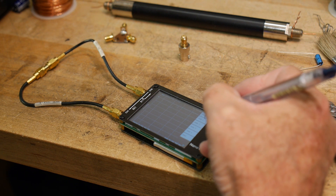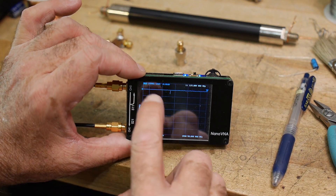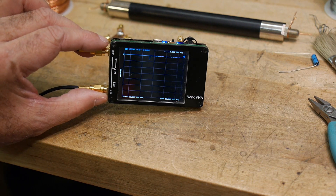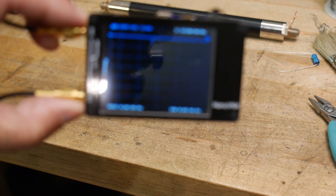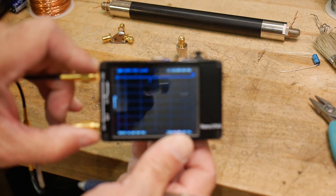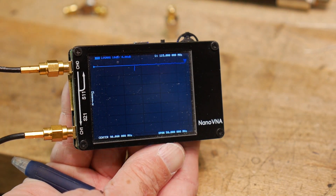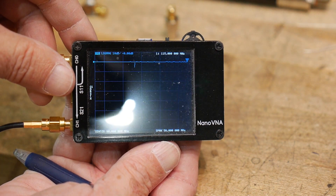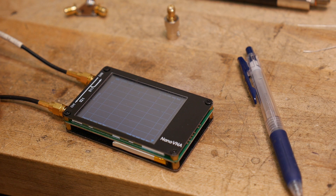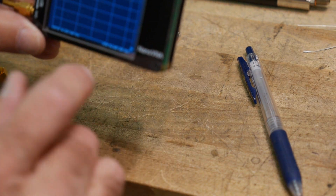We are done. Let's go ahead and save that in one. So we now have a trace along the top. I know it's going to be hard to see. So we're going to have a line up at the top and that just says that we don't have any transmission loss in the system. And when we open the circuit, our trace disappears off the bottom of the screen.